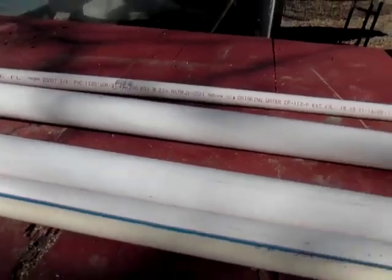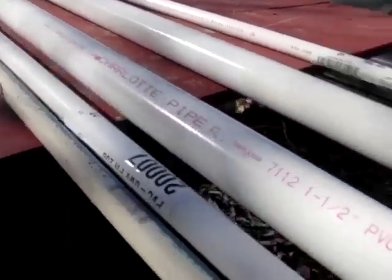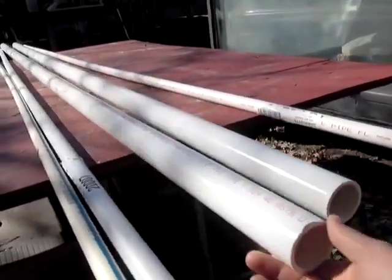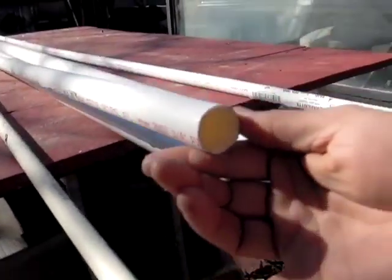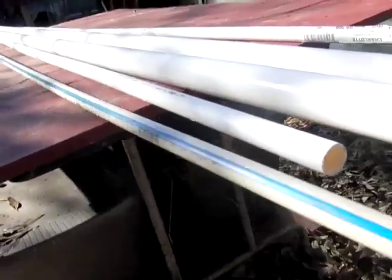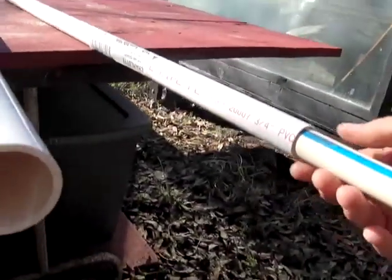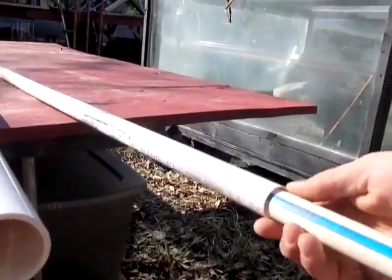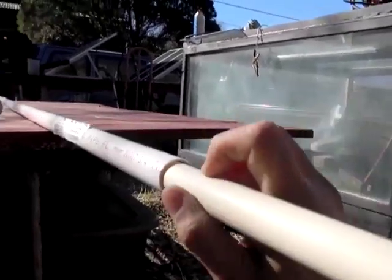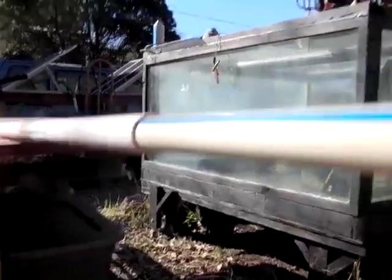So with this project, it's going to cost about $1.30 a linear foot. What I have is one and a half inch regular PVC pipe — this is the thick wall type. I also have three quarter inch regular PVC, which is a thin walled version, and three quarter inch CPVC. One of the neat things about CPVC is that it's a little bit smaller than regular PVC, so when you use the thin walled regular PVC, the CPVC will actually slide down inside of it.